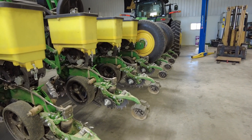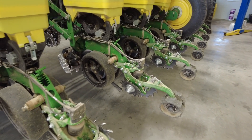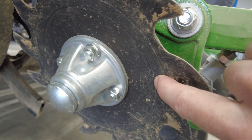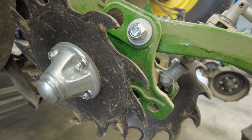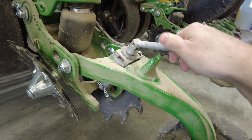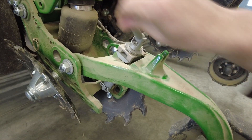We need to get this out in the field, plant seed, and get it set. Setting the depth is real easy — you want to be above where your seed is. There are two lines on these discs: one represents an inch and a half, the other two inches. To change the depth, you click this up — it's got a detent so it holds in place — then crank it up or down and snap it back. Maybe this afternoon we'll take it out and get it set before we get serious. I'm also going to use my emergence flagging kits to compare the Furrow Force side to the OEM closing side to see which has better emergence, and I'll take this all the way through to harvest, so stick around for about six months to see the results.